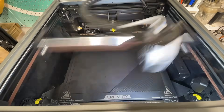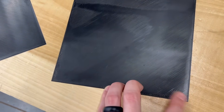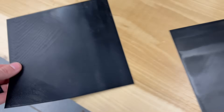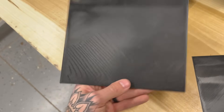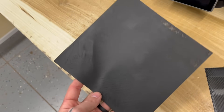Essentially what I did was make a big square that prints a first layer on most of the surface. Here you can see the first one - it doesn't look bad. A little bit of a high spot there, and you can see the back there wasn't quite enough fusion. But overall it's not the worst. Then here's the one after the heat soak and letting it all recalibrate - too much squish up here. I think if I would have raised the Z height a tiny bit this would have looked better. The back does look better. Overall it's not the worst.